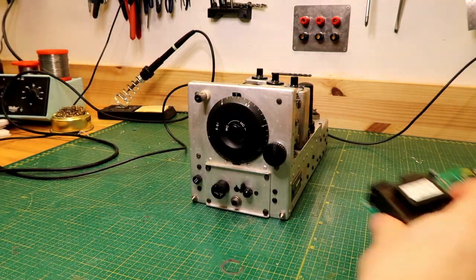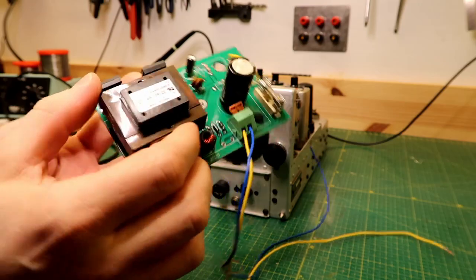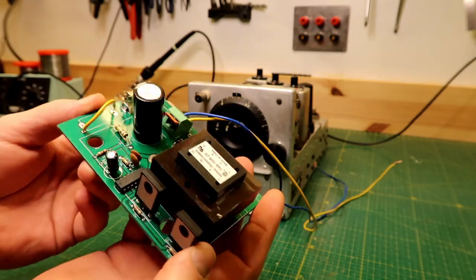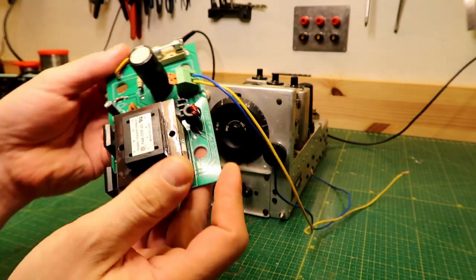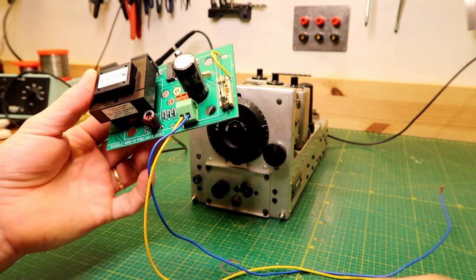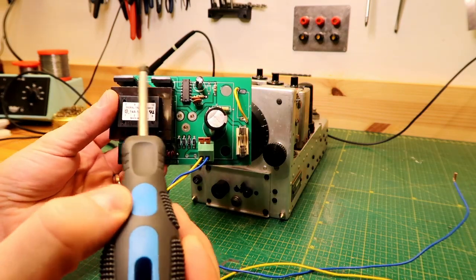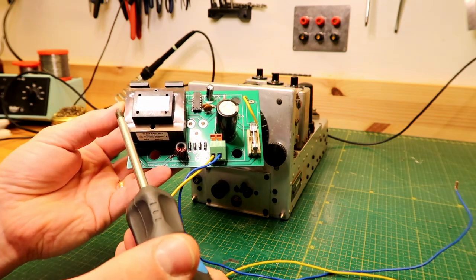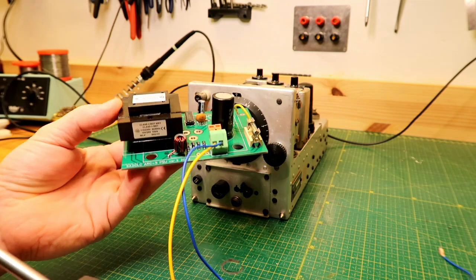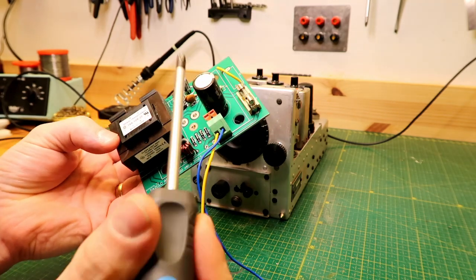The neat thing was that in that class we designed this power supply — it's a DC-to-DC converter made like the old vibrator power supply. This is a solid-state vibrator power supply using a CD4047 astable multivibrator driving MOSFETs, which in turn switch the low-voltage side of this circuit board transformer, inducing voltage into the old primary, which we then rectify and apply to the receiver.